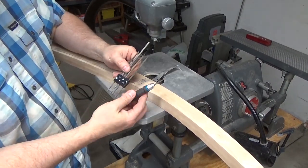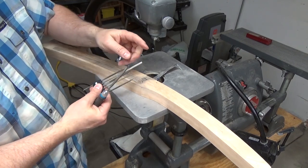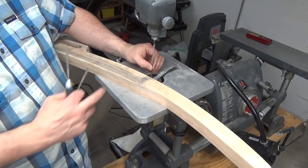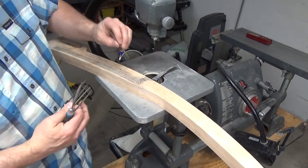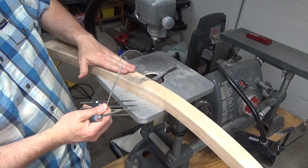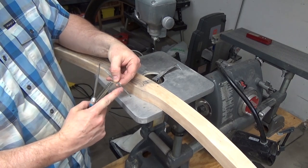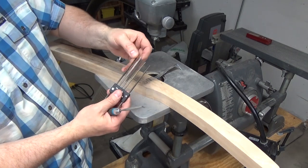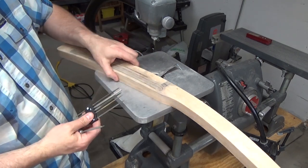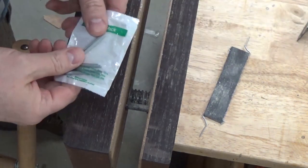I just remembered one more option — I have this little modular needle file set and any one of these would fit. Some of you might be saying, why not mount that in the bottom chuck and use it as a die filer? The answer is the shaft is too long — the cutting part of the file starts partway down, so I wouldn't be cutting through the whole stroke. I could sacrifice it and cut it shorter, but I really don't want to. I also think the file is just too fine — these are not for bulk removal of a large amount of material, which is what I need here. Hopefully you can see how deformed those cotter pins are after using it for a while — they're just not going to hold up.